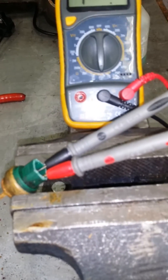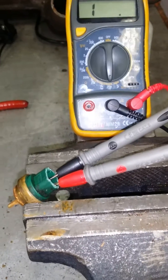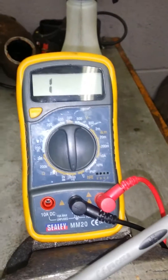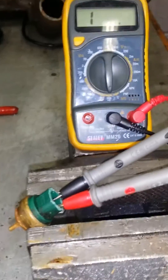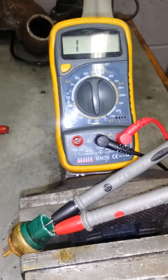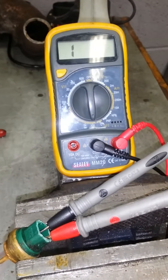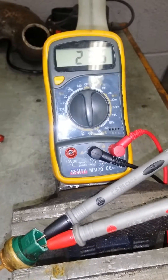It's very important to use your PPE, particularly your safety glasses and your gloves. As you can see, we don't have any form of resistance there, but as I heat this temperature sensor up with a wee bit of heat, you should see the resistance change — and as you can see, it's getting lower and lower.